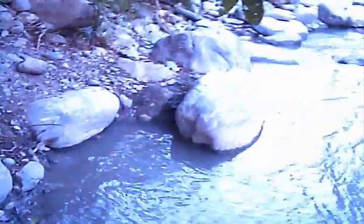As a precaution, I saved all the tailings from this section of bedrock that I hand dredged yesterday. I did check the concentrates and they had fine gold in them — plenty of it. Over here are the tailings from that operation. As part of the sluice challenge, I'm going to classify these down with a classifier screen and then send them through the sluice box to see just how much gold escaped the experimental gravity trap concentrator.